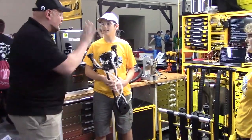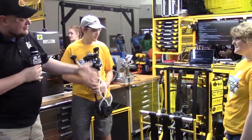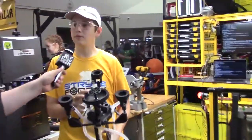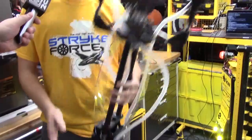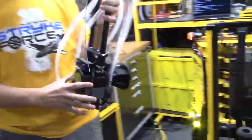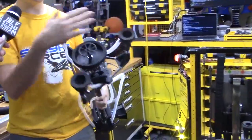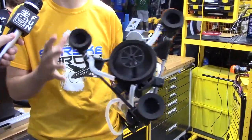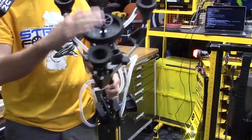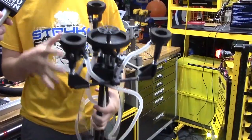We have some really cool stuff to talk about. Trident suction — a lot of big suction on this team. So this is the Trident that we do the game pieces with; this is our end effector. On the bottom, it attaches to a homemade planetary gearbox powered by a 775 Pro, giving it the ability to swivel 360 degrees around the robot so you can place game pieces left and right. Each suction cup on the end is actually actuated so it can comply to surfaces like the hatch panels. It's also on polycarbonate so it can bend left and right when it hits the rocket. And this middle suction cup is specifically for cargo — it's actually a plunger so it can push cargo off, and it's larger for higher surface area and more compression on the ball.